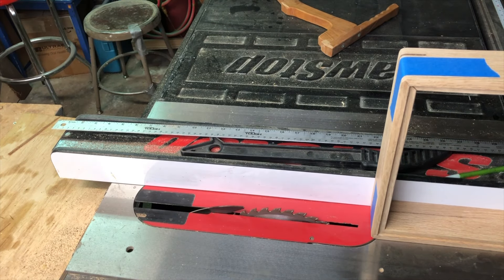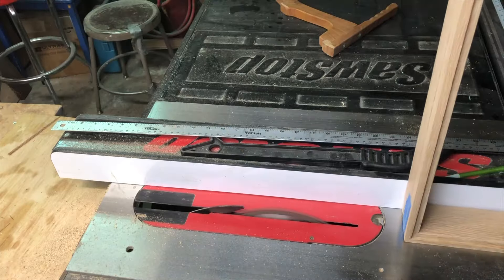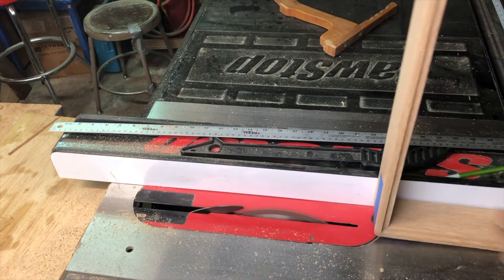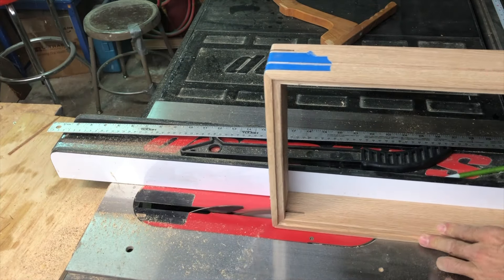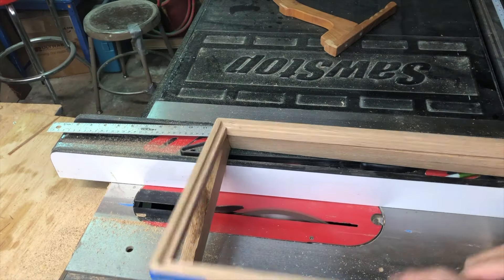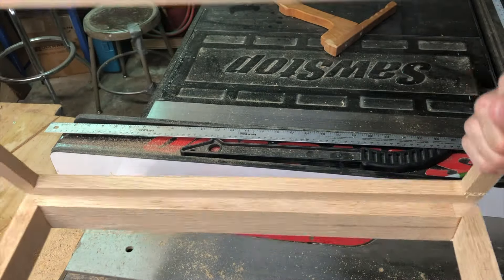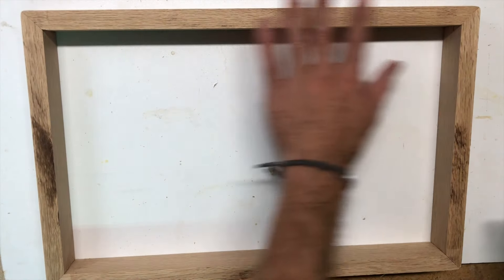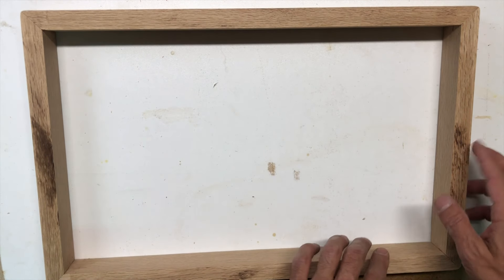Let's test how good this saw stop is. The trick here, if you don't have a jig for tall things connected to your fence, is to push at the bottom against the fence - never from the top or you'll rock it. My right hand is just guiding it forward and pushing down a little, but not pushing against the fence or I'll have leverage and it'll bend over and mess up the cut. Make the cut perfect, and finally sand this up slightly around the edges so you don't get a sliver.